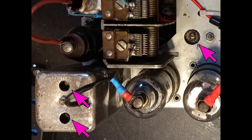If a regular screwdriver is used for tuning it, that would put the B+ in short circuit to the chassis, with sure bad consequences for the coil, possibly the rectifier tube and the operator, that could be electrocuted even if the radio is connected to an insulation transformer.